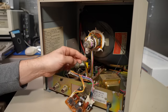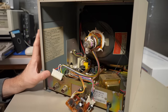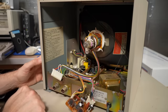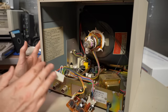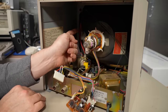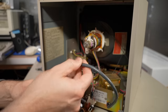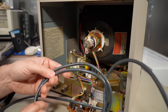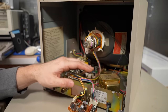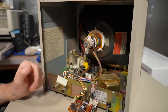By the way, do not work inside a CRT unless you know absolutely what you're doing and how to be safe. I've had this particular monitor for a while and never plugged it in, so there's no way anything inside here is charged. But the CRT itself is a giant capacitor and can store a pretty big charge — you have to be careful. And if you're plugged into the wall, we're talking about mains — 120 volts in North America — that can pack a real punch. If you're in a 220 or 240 volt country, you really don't want to be touching that willy-nilly.